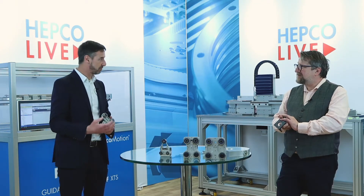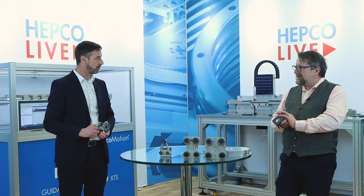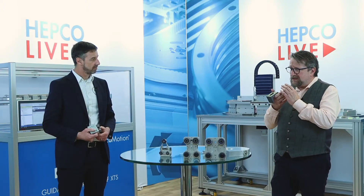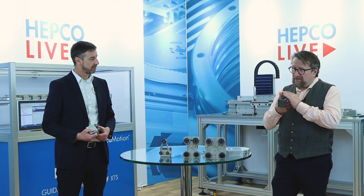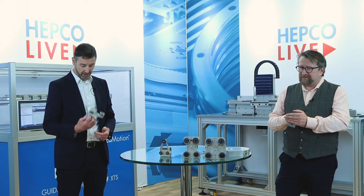You're talking about clean-downs and wash-downs using some fairly harsh chemicals — what have you done to protect the materials from corrosion? The corrosion-resistant coating we use on all the aluminium components is very resistant to most cleaning chemicals, though some are more aggressive and abrasive cleaning is difficult. The seals on the main structure are silicone, so they're very resistant to most chemicals, though strong alkalis and strong acids are always challenging.